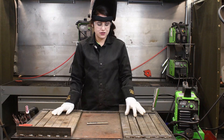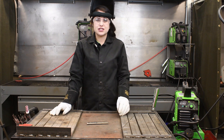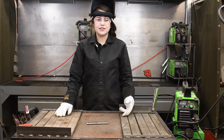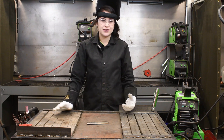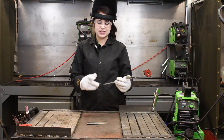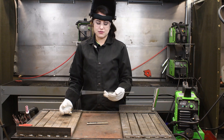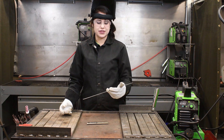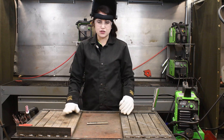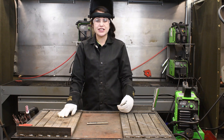A couple things to remember when you are first starting TIG welding: make sure to go slow, pay attention to your weld. If you can't see what you're doing, turn your shade down maybe a notch, or if you use reader glasses it might be a good idea to get a cheater lens — whatever can help you, the better. Also, it is difficult to use filler material especially once you get down to the end of it, so you do have to work on a technique to feed this wire through your hand. A lot of people just hold it with their thumb and then move it, pulling it through with their fingers. That does come with time and it is difficult, so you won't catch on right away. When you are trying to TIG weld, don't let it beat you up and bring you down — you can do it.